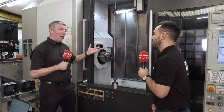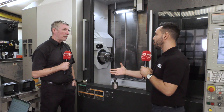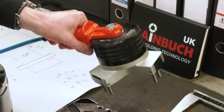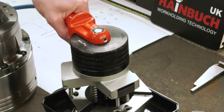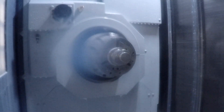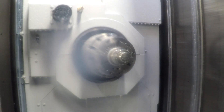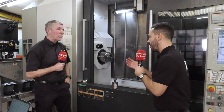There are also associated savings — you get better tool life and spindle longevity by eliminating that vibration. By using a collet-style chuck, there's 100mm capacity on a very small frame, whereas a 100mm capacity three-jaw chuck is a lot bigger. That means it takes a lot of spindle power to start and stop, with corresponding wear on bearings and brakes, so the forces involved with this solution are far less, even while maintaining high clamping force.